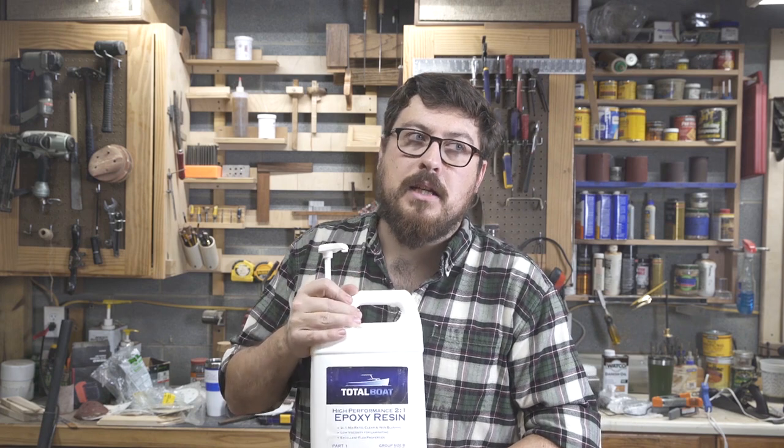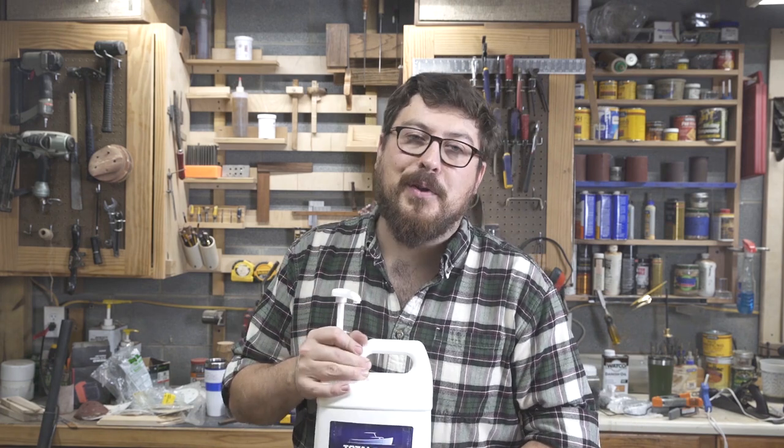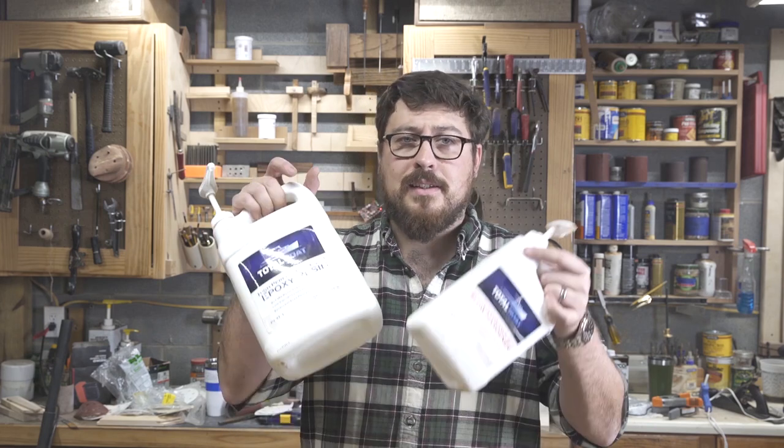One more thing that I like about TotalBoat is that their pump system seems to pump out less volume per pump than, say, West Systems. And what that means is, epoxy is expensive. I think it's like $150 or $160 for this kit. So every pump out of this costs money. I can't do half a pump of this and half a pump of this, because then my ratio would be off and I'd be eyeballing. I run the risk of the epoxy not curing. So with smaller volume coming out per pump, I'm not wasting as much, and I can always add more pumps to a cup to mix as I need it, but I'm not wasting it per one pump.